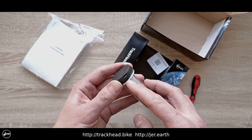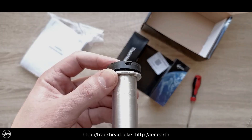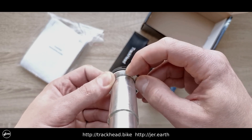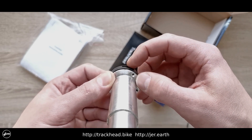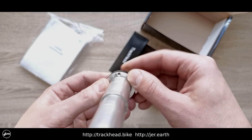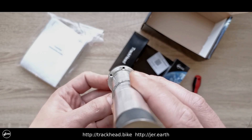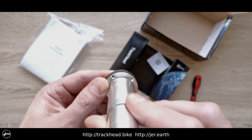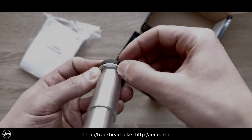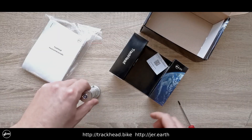The cover must be screwed in carefully, not to damage the aluminum flange, screws, and threads. Pre-place the screws in the holes and make sure each screw fits directly and perpendicular to the threaded insert. Do not tighten the screws immediately as far as they go — stop screwing once the head is seated on the flange. Then tighten the screws evenly and alternately in small increments as far as they will go. If the screws are tightened unevenly, the resilient resistance of the rubber seal could cause the device to jam and result in damage to the cover, screws, or other parts.